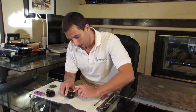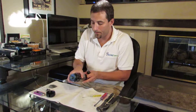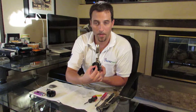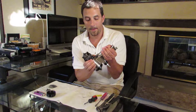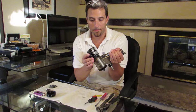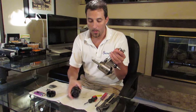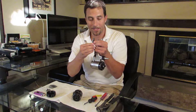The next thing we have to do is pull these side seal chambers out a little bit so they're not pressed up against the mixing chamber — sometimes that can be difficult, but we've got that done. Now they're sticking out a little bit so the mixing chamber will wiggle. Now that we know they aren't pressing up against the mixing chamber, we can go ahead and unscrew the lock ring and free up the front of the gun. If we had attempted to unscrew the lock ring while the side seal chambers were pressed all the way in, we could have scratched up the mixing chamber.